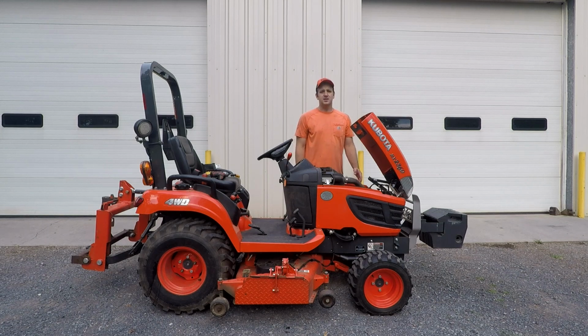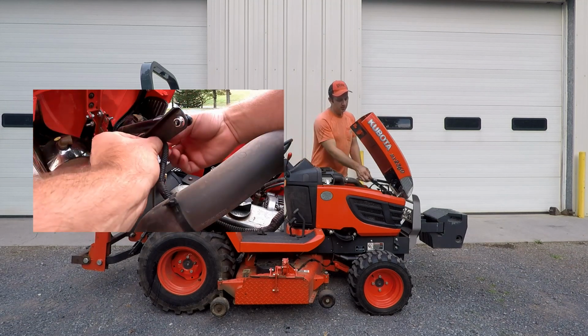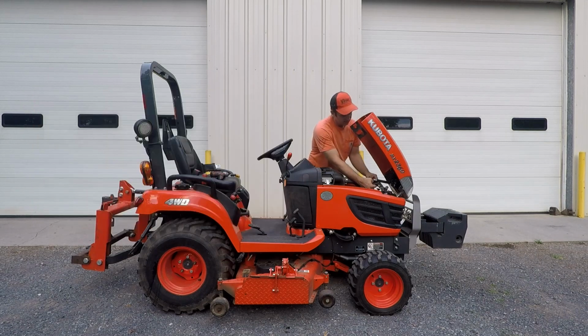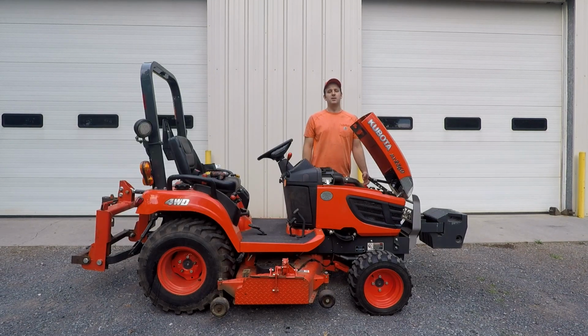Now that the headlights are disconnected, we need to remove the wiring. You can squeeze it together with your fingers or a pair of pliers. Now that the wiring has been removed, there are 4 nuts with a 12mm hex on them that we need to remove.